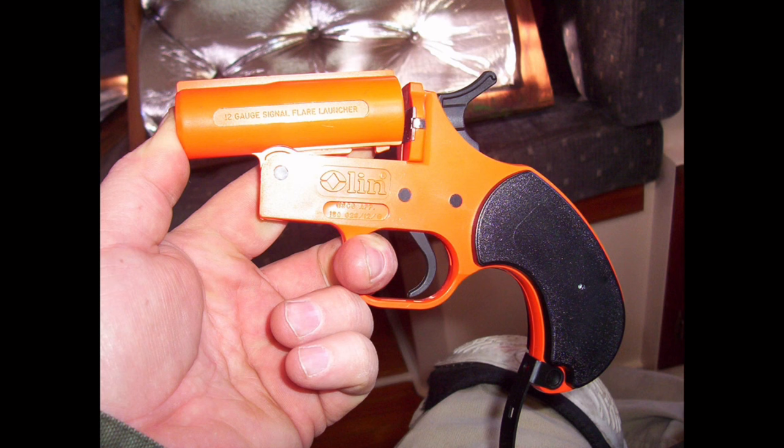The problem is the nylon material used to keep the breech closed can swell or deform and jam the opening mechanism. Any Olin plastic flare gun is suspect, as are Orion guns made before 2000, which is the year that the mechanism was re-engineered. Guns with the modification have the U.S. Coast Guard approval code 160028/12/1 stamped on the body of the gun.